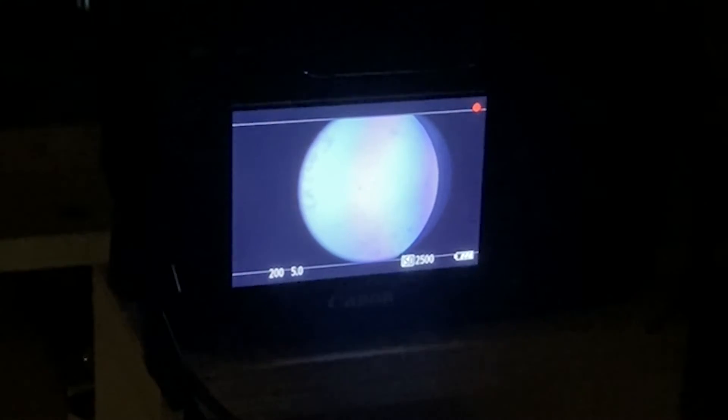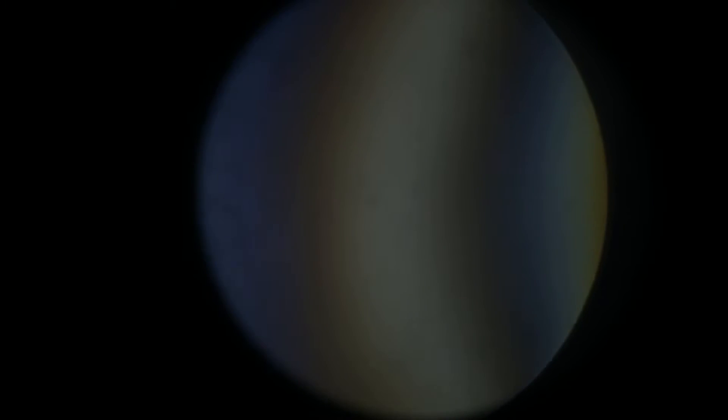So at this point, we're going to turn on the video camera here from our lens and see what we see with that. We'll go through some different defocusing and look at what the Wollaston prism can do. But once you start to see these colors, you know you're very close. Now we're within range of using the micrometers to move that Wollaston prism back and forth — that's going to be really close to where we want. I'm going to change the polarizer on the front of the camera to get the best position.